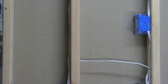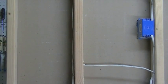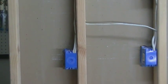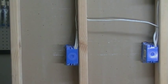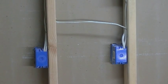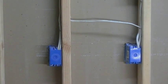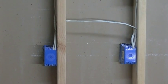Now that you have the power shut off at the main circuit breaker, we're going to show you a little bit about what's going on behind the wall so you can understand what's going to happen when we're changing the GFCI outlet. The outlet box on the left-hand side of the screen is where the GFCI is, and you can see the wire going across over to the other outlet. Now that GFCI is either feeding this outlet protected through the GFCI, or it's connected to just the hot lead where the GFCI is not protecting those circuits.